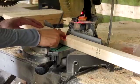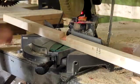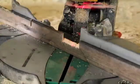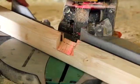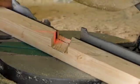So we cleaned out our first cut, and our curve is almost perfectly centered. It's a little bit favoring one side, not going to be a really big deal for us. Now that you have the first part set up, you can't just flip your wood, because if you do that, you're going to end up with the same. So you want to come back here and set your saw to 45, the opposite direction.